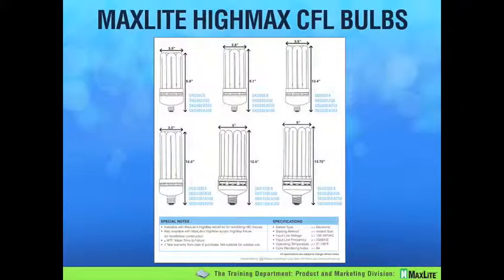What you're looking at here is one of several pages of a cut sheet for this product. It demonstrates that we have a full lineup including voltage options: we have 120V and 277V, and for our Canadian friends we also have 347 volts available. In some cases we offer warm white as well. Generally, for scotopic performance and simply better, brighter light, the 5000 Kelvin is outselling warm white probably 10 to 1 or more. But warm white still has a steady market in houses of worship and a few other select applications, so do consider that as well.